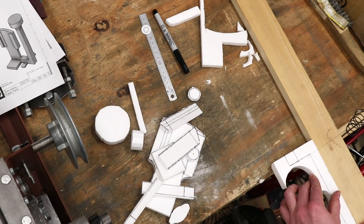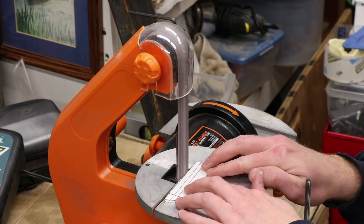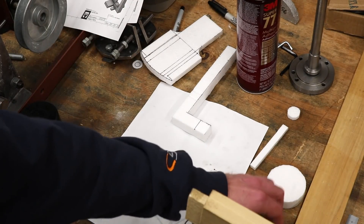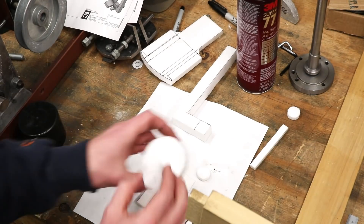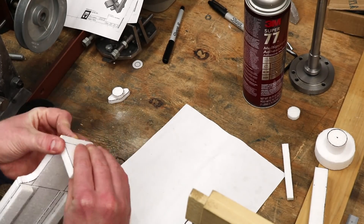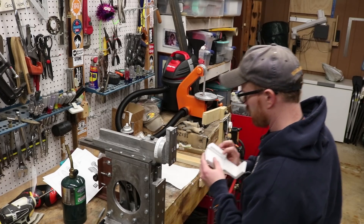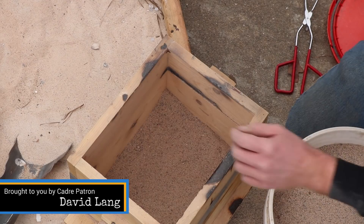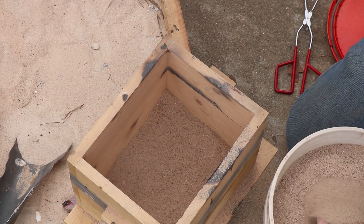After I've got the parts cut out of the polystyrene, I use my sander to clean them up, and then I spray on a little bit of adhesive, and I test it with my fingernail like the instructions say until it's tacky but won't stick to your fingernail, and then I assemble the part. After I've got the part assembled, I check it on the machine to make sure it's roughly what I'm expecting, finish clean up sanding, and then encase it in plaster of Paris. I made a tree so that way I could cast all three of these parts at the same time, and then lastly I embed it in sand using my vibratory table.